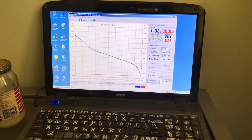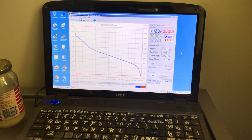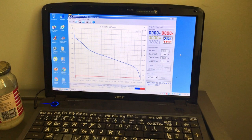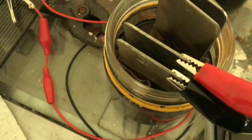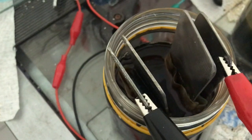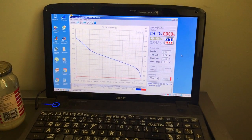The manganese and feather carbon cell still works at 68 milliwatt hours and 52 milliamp hours but doesn't seem to take more than an hour's charge. The activated carbon cell doesn't even have a voltage — I'm having trouble getting a reading off it. Zero volts when connected normally. But connecting it to the other plate gives 0.4 volts.